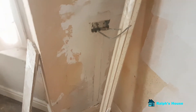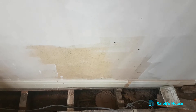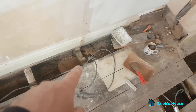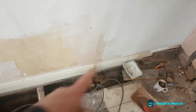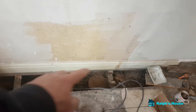I've started to splay the wires on that one — the power's off on the sockets up here, obviously. So what I thought I'd do: I've got some wall lights that need to go in downstairs, and as the boards are up here it makes sense to drop the cables down today. Now it's not quite as simple as you'd think. This is the chimney breast up here — it runs into that corner — but downstairs the chimney breast starts there, so it slopes up under this board. If you want to put a wall light on one side of the fireplace and a wall light on the other, it's going to be an interesting route.